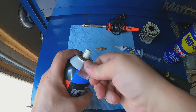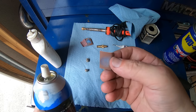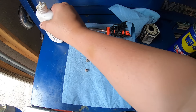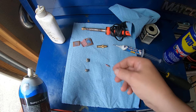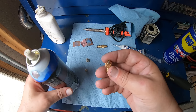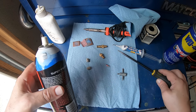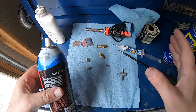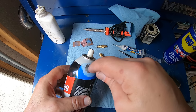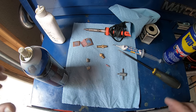I got the little spot cleaned off — took about three or four minutes with the emery cloth. I also hit it with some acetone and scrubbed, and it came off pretty good. Next I'm going to clean this up real good, make sure it's perfectly clean, then poke a hole in here using a punch. To me that's a better method than drilling. If you do drill, use an automatic center punch to get a spot first so you're not walking all over the can.